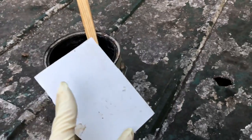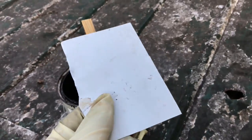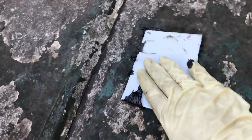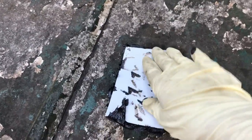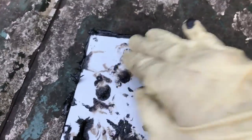What I'm going to do first is put a thick coating on the bottom side of this piece of tin. Something like this should work. Then I'm going to put it down on top of the hole. Press down firmly on it, using that cement kind of like glue. Now I'm going to push it out, feeling for it to squeeze out around the edges. You can see it squeezing out around it.